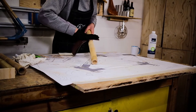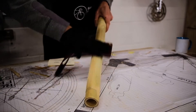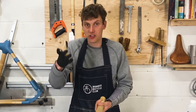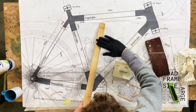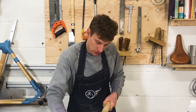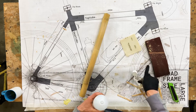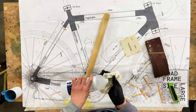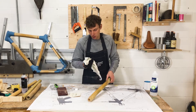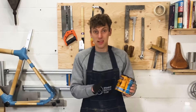We're just going to open the grains up using this 60 grit sandpaper. Then the next step is to give it a polish with a 180 grit, which will get it smoother — make sure you feel it with your hands as you go. Finally, take the same alcohol cleaner and clean off any excess oils or sawdust. Give that a really good clean and just allow it to evaporate off — you can see it's looking nice and sharp.